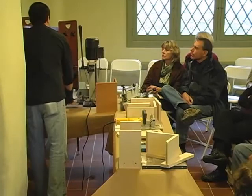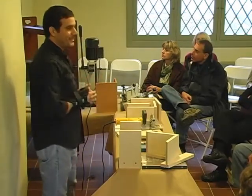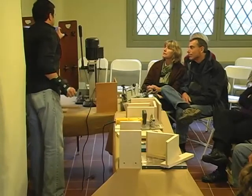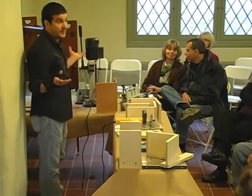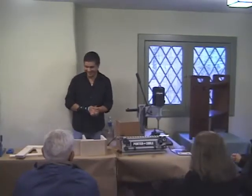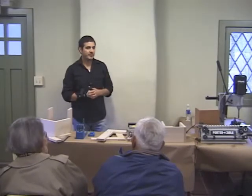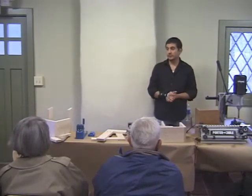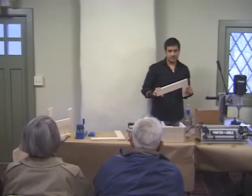This is a blind mortise and tenon — you won't see it. This one comes out. Why do they make it come out? It's not because it's stronger, but it looks better. Now, a lot of companies today are cheating — they glue everything, take a little piece of wood and just glue it on. It is wrong. That motivates me to become a true craftsman, because there are not many craftsmen doing work like this today. That's why we're able to charge more than a mass production place or one using pocket holes for your entire furniture. Want something like that? Go to Ikea.